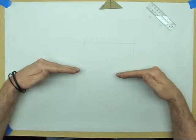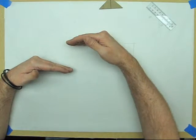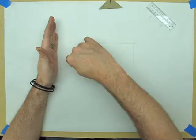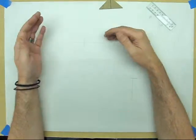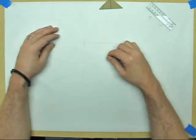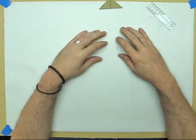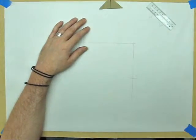When I measure, they're never at the same height, so do I measure from the fitting to the bottom of the tube, or to the top of the tube? Am I using the inside radius or the outside radius? Do I need to use a K factor? Do I measure from the end of the bend down? It's just a bunch of crap that you don't want to mess with.